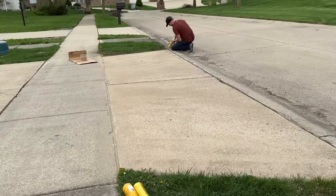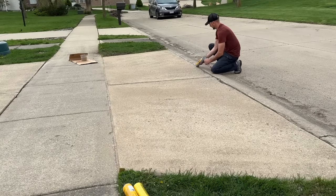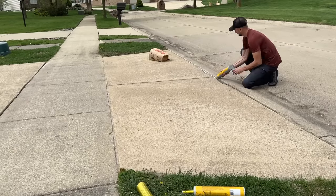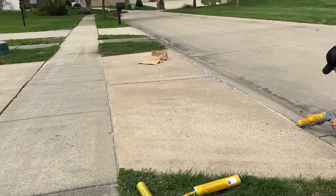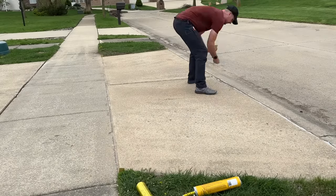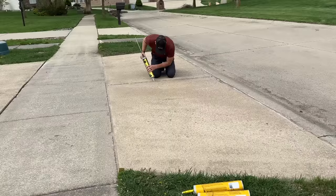You'll want to take your time. I've run into issues in the past when trying to apply this in direct sunlight when it was about 80 degrees Fahrenheit or higher — what I've seen is it can bubble a little bit and your overall finish isn't the best. It's about 65 degrees Fahrenheit outside today. It's super windy, which is not ideal, but applying that sand on top does help to minimize the amount of things that will blow across and stick into the caulk while it's setting up. Here's the finished product — you'll see how it blends in. The Sika with a thin coating of sand on top really helps blend into the driveway, and transitioning to that perpendicular crack with the Tremco 45 SSL in limestone looks pretty great.